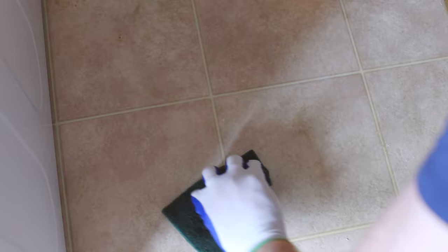You don't want any dust, dirt, residue, or grease left behind. I highly recommend enlisting the help of a really great degreaser — I'll link to the one I use in the description below. This will create a smooth, durable finish. Mop, wipe, or rinse until there is no residue remaining, and allow the floor to completely dry before moving on to the next step.